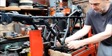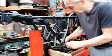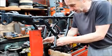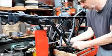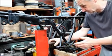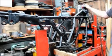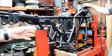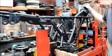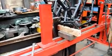Yeah. But the odds of moving that hole, we've put a 14 mil spindle in, and it's fine. It's all right. But what I need off our Les, there's a sleeve that goes in the swinging arm, and we're going to put a sleeve on it, and then I might have to machine something to go on, to slide it through. All I want to do is slide that in and make sure the spindle pushes through nicely while it's clamped on there. Because this is all vertical and perfect, as is the headstock, you can make sure it's not bent in any way or twisted. Okay. So he wants to be sure that they are right before he gets it all powder coated. Okay. So there's the frame jig there.